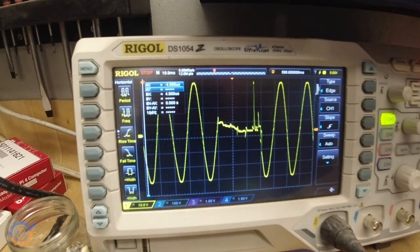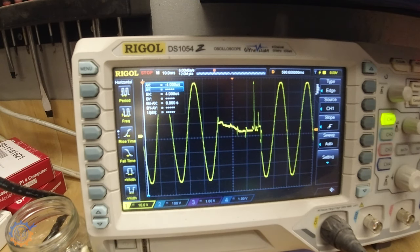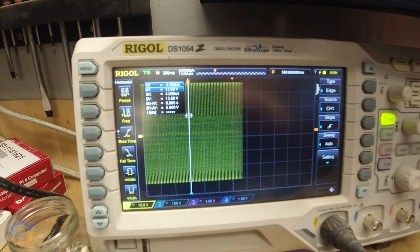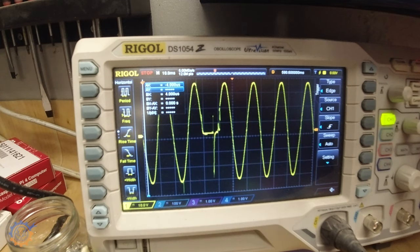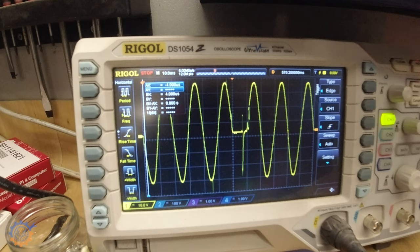The trigger time depends very much on how it slaps from one side to another. You can also clearly see there is no zero-point triggering, since it is a contactor — it starts in the middle of the pulse. Let's do another test. There we have another trigger — in this case we had an outage of around 10 milliseconds, and that's pretty decent. Between 10 and 15 milliseconds most gear will survive. When you go towards 20 and above you get issues. Using contactors, 10 to 20 milliseconds is very normal, and 20 and up is extremely normal on cheap Chinese gear that isn't rated for it.